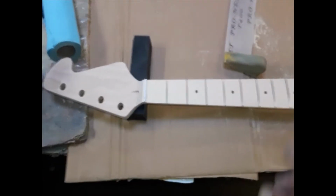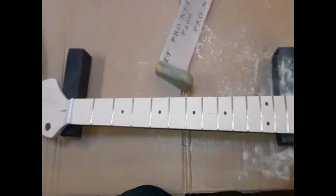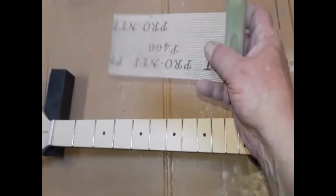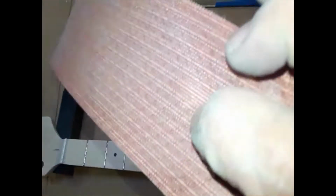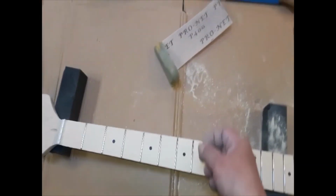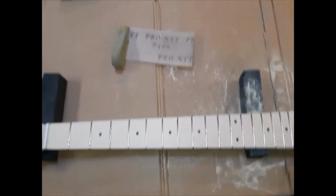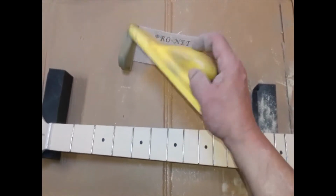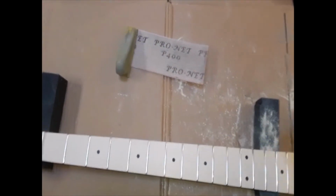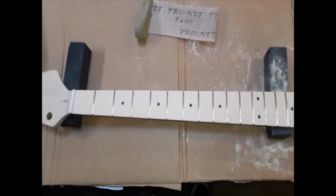Right on. So I've done 320 on the back of the neck, the headstock, fretboard, and I'm just going over the fretboard right now with some 400. Remember that 400 that I was sanding the body with the other day? It's that same piece. Isn't that incredible? I found out the name of this stuff, if you want to look for it somewhere in the world. It's called Wonder Weave. It's the strips they come with, a particular size sanding pad. They've got a hard one and a flexible one. I know I'm showing you that in advertising form because I'm not getting any kind of sponsorship from anybody, but hey, just in case you were wondering.